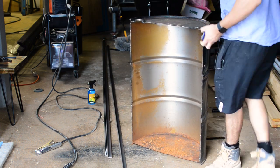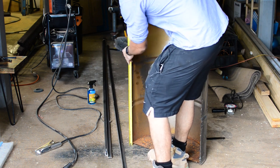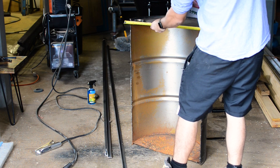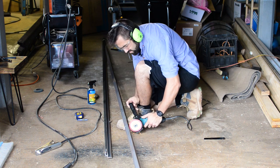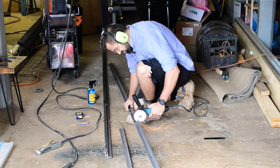The steel I got was 30x30 angle. I firstly measured the long side and then the short side, added about 100mm to those lengths and cut those 4 pieces. At this stage I really wish I had bought a metal cut-off saw — it would have made this about 600 times easier and about 600 times faster.